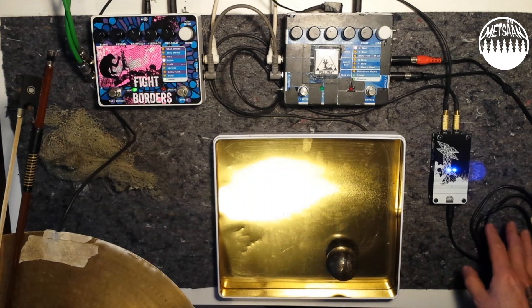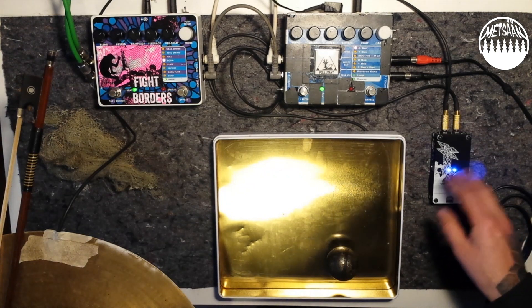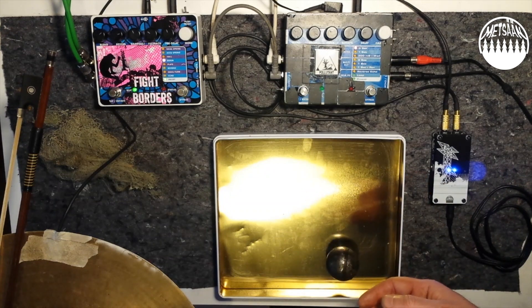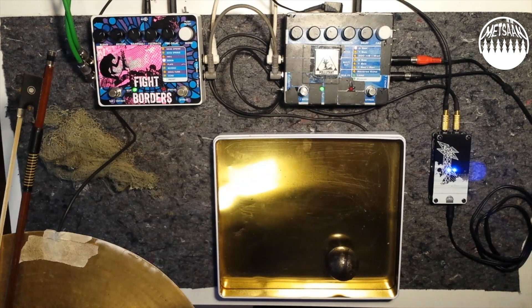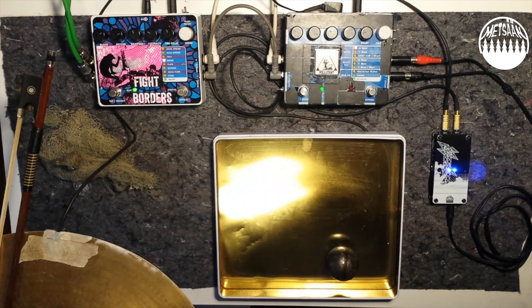This one is a so-called charge amplifier. It works differently than a high impedance amplifier and has several advantages. It has no hum. You can use long cables without messing up the signal, adding hum, or having weird frequency responses. In general, the pre-amplifier for piezo contact mics — the idea is to get a full frequency range out of this otherwise very high-frequency-prone piezo thing. If you just plug it into whatever, you get a very weird — for most people very normal for piezo mics — frequency response. With this you get a very wide range of frequencies, no hum, and a lot of gain.